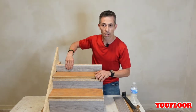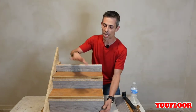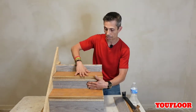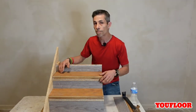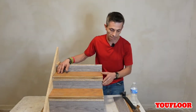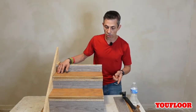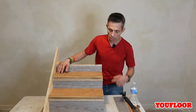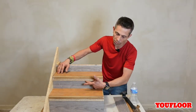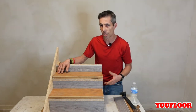A lot of people put the risers on and then slide the tread in. I build them from the bottom up — I put the riser in first, then set the tread on, then set the riser on top of the tread. But this guy left the nosing on with the old steps on, so I'm not exactly sure how he did that. You have to just research and see. She has a lot of steps, so this is going to be time-consuming, but you're going to have to have some patience.